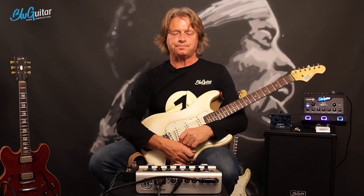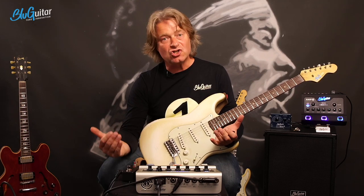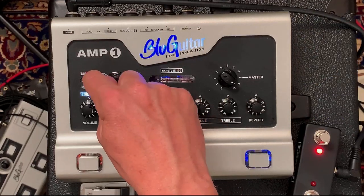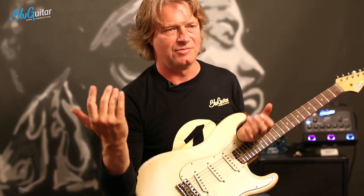Martin Debonet asks: could I use the custom controls to have a normal volume clean and normal volume rhythm sound (classic), and then a louder solo? Yes, that's actually the concept of the custom control. You can dial in the volume for each channel and get each channel at the position where you want to use it. You can have the vintage channel for your lead tones and simply crank the master volume for overdrive, and reduce the classic channel for just your rhythm volume. Every channel can be at its own specific volume level and you can make your own set of sounds as you like.